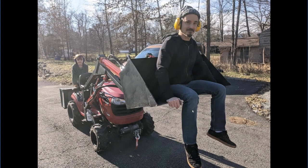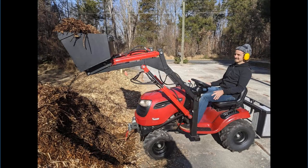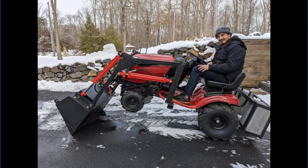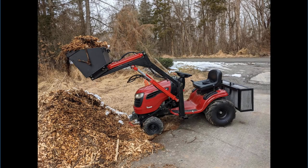You can see it is at least enough to hold me up, which is more than I need — I'm mostly moving wood chips, not big boulders. You can see clearly it'll hold the wood chips and another child, and it's good enough to lift up the front of the tractor. I've switched to tiny wheels on the front because the larger 8-inch wheels would run into some of the plumbing on the filter side. I don't think those will be the final wheels. You can see I can get a full bucket.